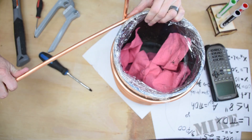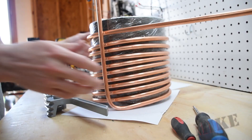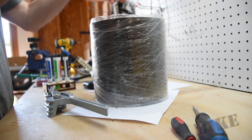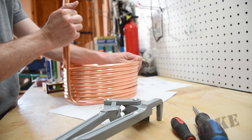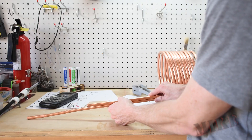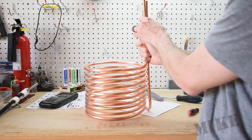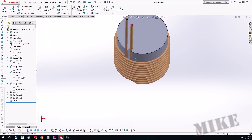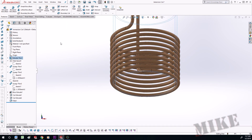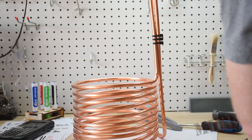Then I straightened the remaining tube at the top of the coil to make the second bend, and it was time to come off the form so I could get the bender back onto the tubing. This last 90° bend at the top was somewhat tricky, but I made it work by making the bend slightly out of plane and then twisting the tubing into the vertical. That looks really good! In the end my tubes didn't come out equal because of the pipe size and integer wrap requirement, but it's actually okay that the first straight section is on the outside of the coil — putting it inside would have been a manufacturing nightmare. DFMA all the way. Some zip ties hold it where I want it while still allowing spacing and height to be adjusted.